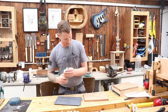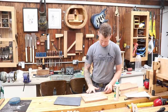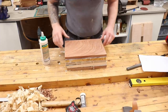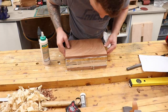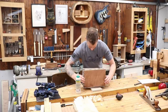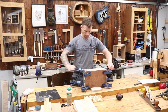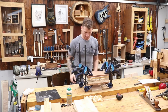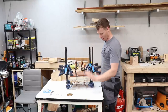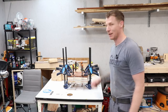Not much to this — just layer it up really. Plenty of glue, and your finger is probably one of the best glue spreaders you have. That's the final piece of the cake — that's going to be the front of the box. Let's get this clamped up. We're all glued up. I've got a lot of squeeze out, which I don't really mind. I'm leaving it on my assembly table because it has a melamine top that glue doesn't stick to, so it can drip all over that and I can scrape it off.